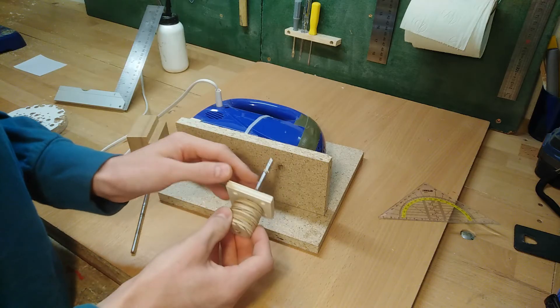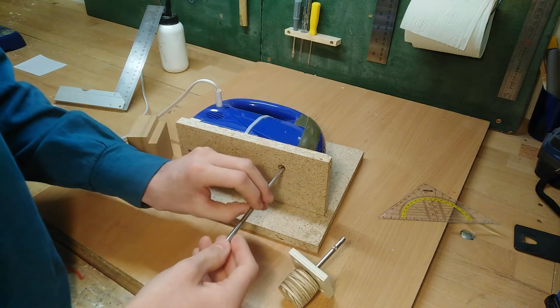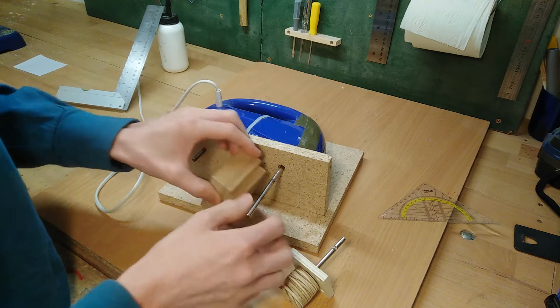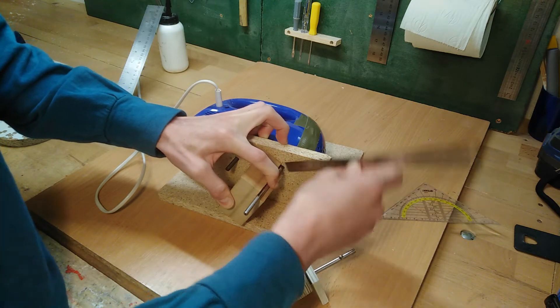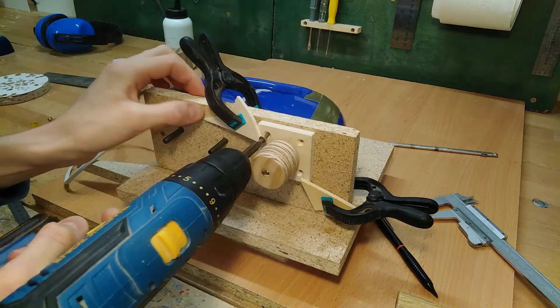Since I kind of need to get the wheel on there straight and the output shaft on these mixers is just more than a little bit slack, I'm using this square block with a cutout on one end to get the shaft straight and then measure its position in respect to the chassis, which then allows me to measure out the exact same thing on the real deal before screwing it on.